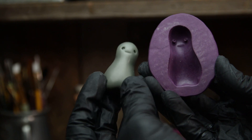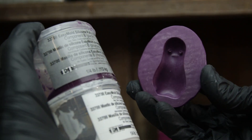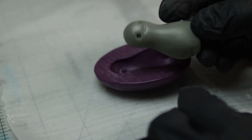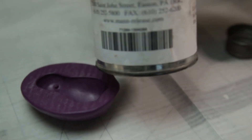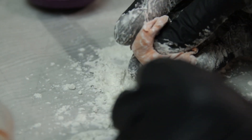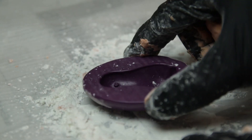I wanted to show y'all this — something I made previously. I made this little figure right here using epoxy, and made a mold out of him using an easy mold. So what we're going to do — let's say we want to make a little squishy version of this little guy, a stress reliever version. Remember, the silicone doesn't like to stick to a whole lot, but it will stick to silicone. So I'm going to take me some mold release — but you can use anything, even Vicks VapoRub. Get the silicone going and just keep folding it over into itself. By adding all this cornstarch, it's going to accelerate the drying time and greatly accelerate the cure time. Then press it right into the mold.